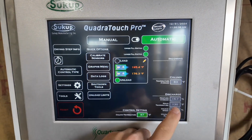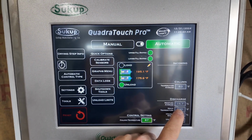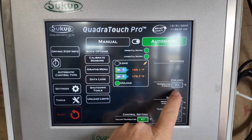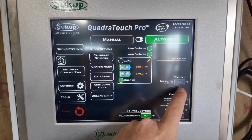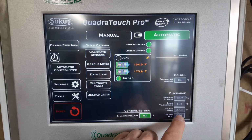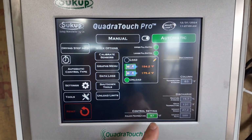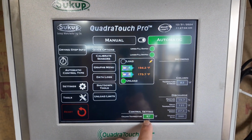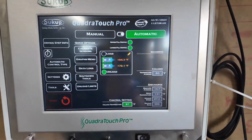And we are at a 15.8 on moisture, which is pretty nice. And we're at a temperature of 83 degrees. So that's coming up slowly. This is dropping slowly. We're at 27% unload speed. Nothing's bad here. This might be a little bit high of a number, but I'm just going to let it set for another half hour or so and see what happens.